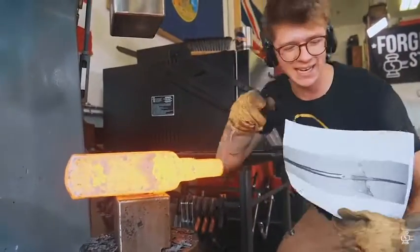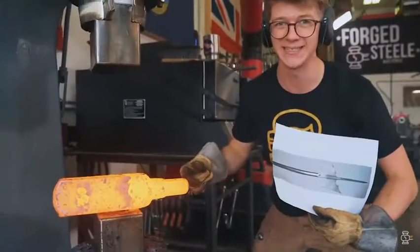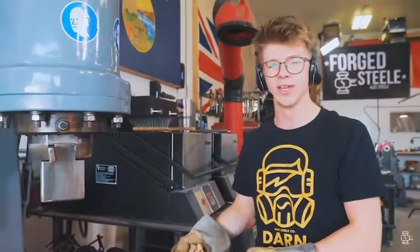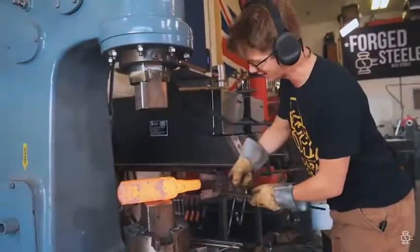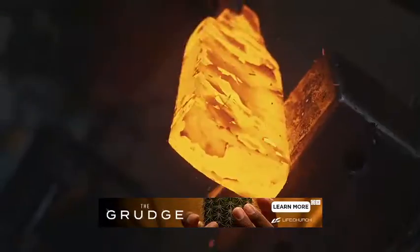This right here is going to be that top spike on the halberd. We've got to isolate it down, and it's actually really helpful to do it now because I am struggling to hold on to this monstrous piece of steel. But by having broken it down and left it like this, holding on to it with a pair of tongs is now 10 times easier. So we're now going to isolate the material for the tang area, the bit that's connecting to our wooden handle.